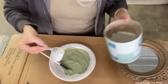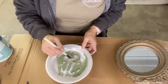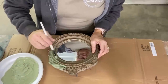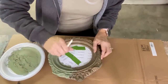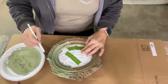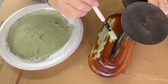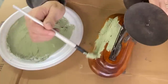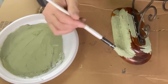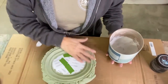Here's a technique I found — I don't remember where I picked it up, but I really like it and I'm painting a lot of things with it. I have three projects to do this paint finish on. The first coat gets some salt wash mixed into it. I started to do the mirror without covering it up and then thought I'd have too much of a mess, so I covered it with paper and painted it with salt wash in Gypsy Green using a pouncing technique to get as much texture as possible. If you've used salt wash before, I'm sure you've done that technique, but here's where it becomes different.